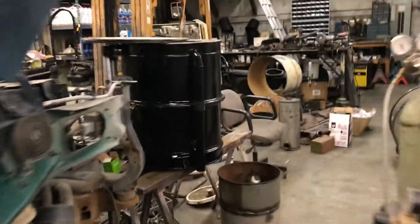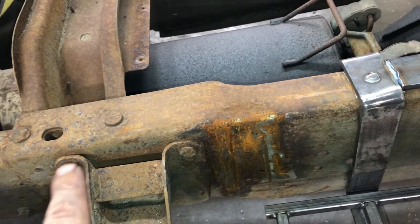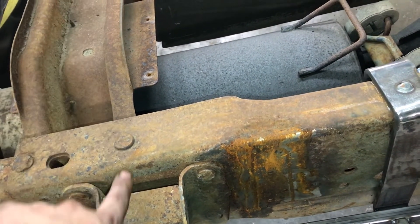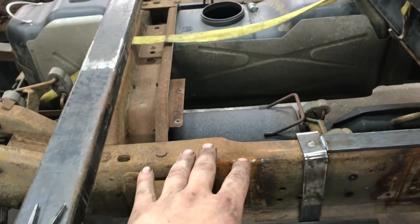For the hopper temp probe I actually did it a little bit different — I just knocked out the hole, tapped it. The sheet metal is too thin for holding threads and I knew that, so I took an old brass nut, threaded that, and put a little skiff of silicone on the back side — so that's done. I got that piece of strapping across the frame rail. I'm actually not going to add strapping through here for two reasons: I don't want to cover up this rivet that holds the two pieces of frame together and this cross member, and also there's a slight rise in the frame rail right in this area, so this would be a really funky bend piece to get in there — a whole lot of work but not a whole lot of support.